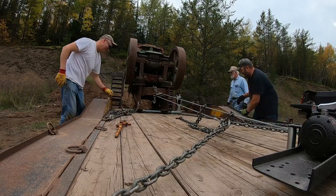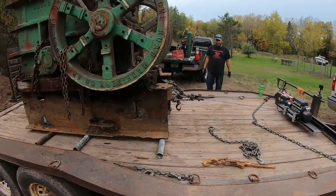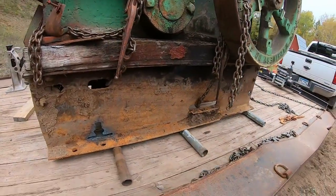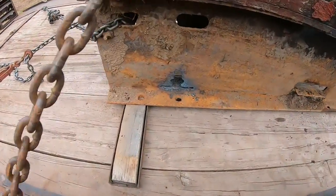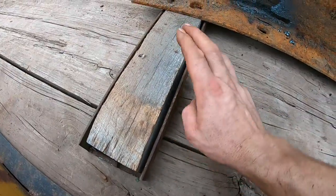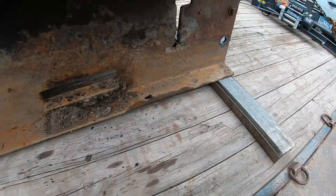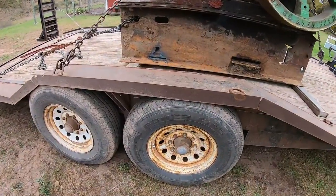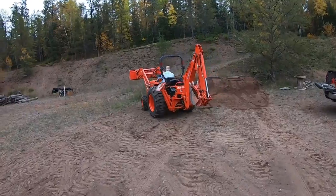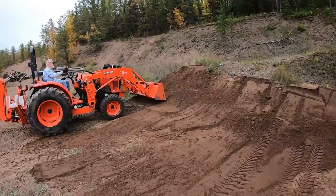She's springy. We're chained down and we took the rollers — the pipes — out from underneath. We've got some five-inch C-channel with some rough-sawn oak two-by-fours in there, so we're steel on wood on steel on wood so it doesn't get slippery on the bottom. We're getting a little tight on clearance, but Rick's confident he's going to make it. Senior is over here erasing the big crater we made in the bank.